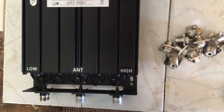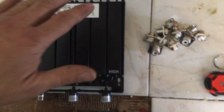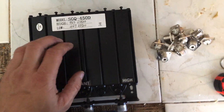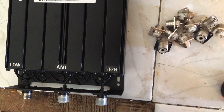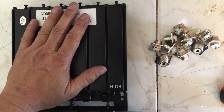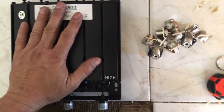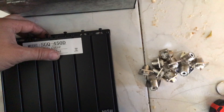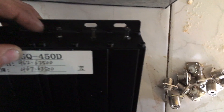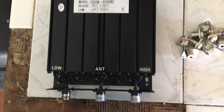For my testing purposes, I'm going to be testing this off the workbench, so I'm not going to worry about a box. Anyway, this is a 50-watt duplexer — the cheapest one I could find online. It came all the way from overseas and took about a month to get here. They already tuned it; I can tell because the threads were painted, so someone clearly did unscrew this. It has been tuned.